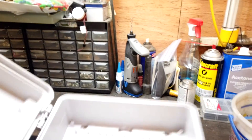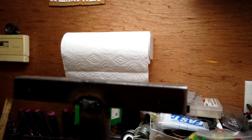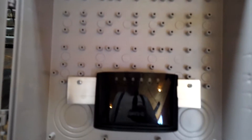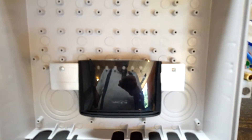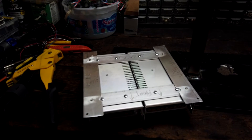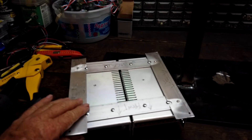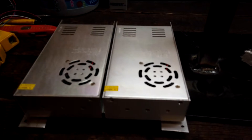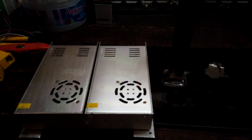The box itself — I've simply drilled a hole on each side, same with the crossbar here, with matching holes. I'm going to mount one on each side. This particular box has my D-Link Ethernet switch mounted in it, so I'm going to put it up on the post now. For my two power supplies, I simply cut four pieces of this sixteenth inch, inch and a half wide aluminum, drilled them, pop riveted them together, and screwed my two power supplies onto them. This will just drop right down in that cable guard box and screw in.